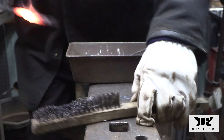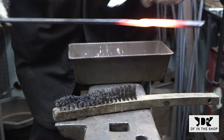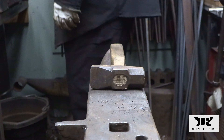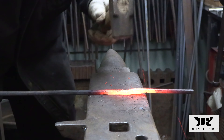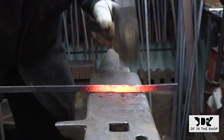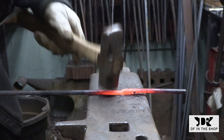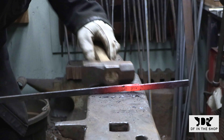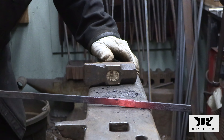It's important to realize that now that I have good clean contact between the entire weld joint, every minute I spend at welding heat and every heat cycle I take it through — from below critical to welding temperature — all of those things are going to contribute to the strength of the weld. I'm just doing light, firm hammer blows to encourage the two faces to push together. The contact of the two faces, the heat, and the time are going to do more to create a good weld than heavy hammering at this point. Once you have a good tack weld set up then you can go into the heavier hammering to actually shape the weld. But if you rush through this process the strength of your final welds are going to suffer.